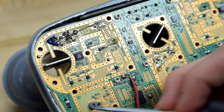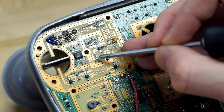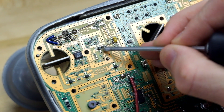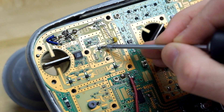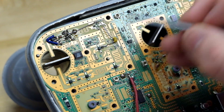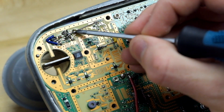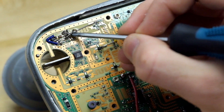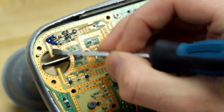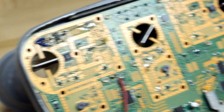The DRO is right here. On the back side there's a piece of coax with a solder point here, and it ends up right here, then gets amplified by another FET. I'm coupling that negative two volt oscillator signal through about a 100 picofarad ceramic cap — I don't know the exact value, I just grabbed one — all the way over to this point here, which is the gate of a FET. The drain of that goes to the gate of another FET, and then the drain of that FET goes to an antenna. So that's it — it's really not that complicated at all, even though this board looks really complex.